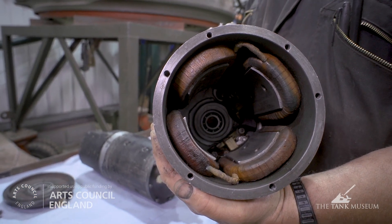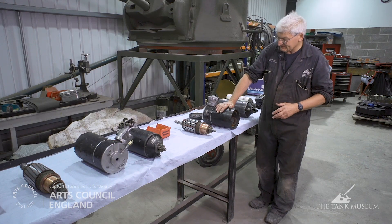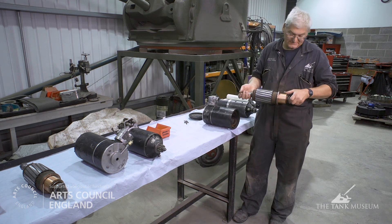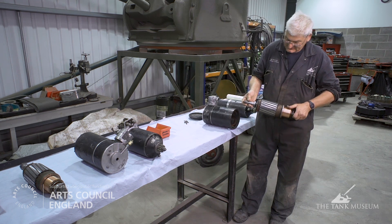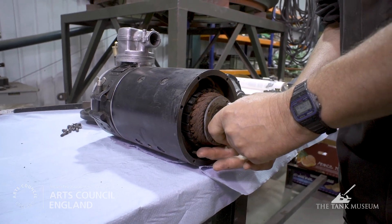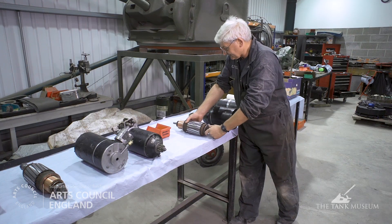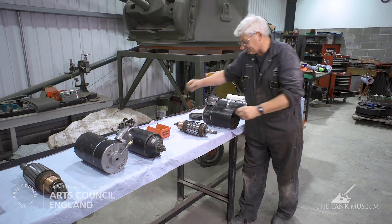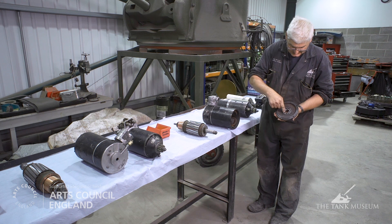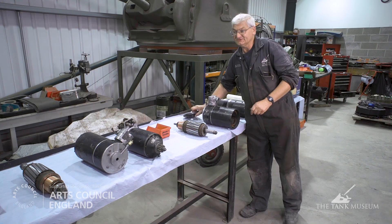Happily, they were found to be in excellent condition — really only needed cleaning. That's the dynamo. This is called the yoke on the outside, and this is the armature. We've basically polished up the commutator, which is the copper part you can see there. That actually fits and goes inside. It's simply awaiting the new bearings. Once we've got those, we'll fit them on the end of the armature. The bearings go in the end of the cap there. We will change them, repack them with grease, put them back together, and that's ready to go back on the engines when they're rebuilt.